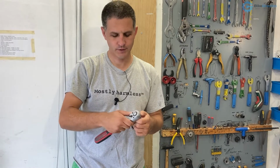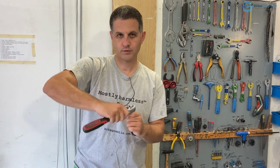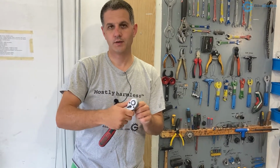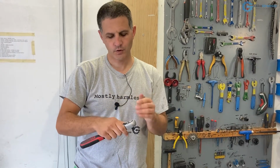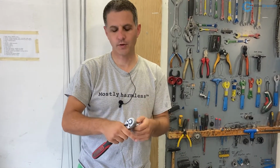It becomes like some sort of glue instead of grease, especially if you go with some harder greases. In that case, if you notice that this is not catching very nicely when you want it to tighten or loosen, open it, clean it, and then re-lubricate it. Do not use a wrench if it does not lock nicely and positively, because you will damage those fine ratchet teeth and it will never work properly again. So those are some things to pay attention to.